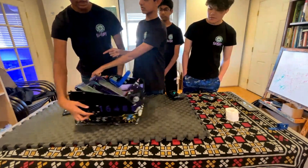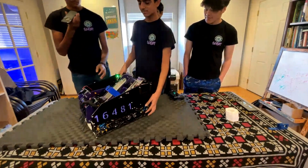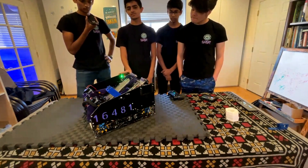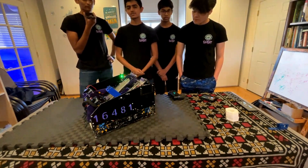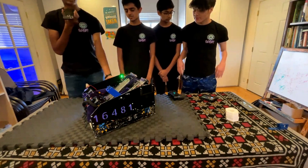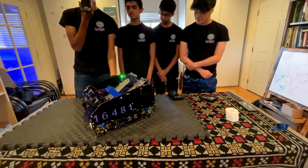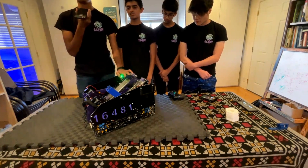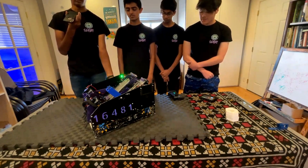The main sensors we use on our drivetrain are the two ultrasonic distance sensors integrated within our side base — there's one here and one on the other side of the robot. These are the MaxBotix 1240s. We use the analog version because they have a higher polling rate than the I2C version, and that allows us to achieve higher loop times.